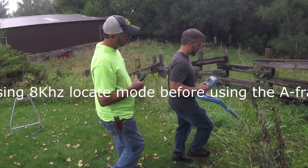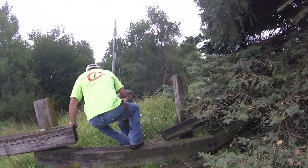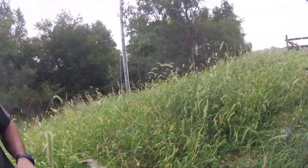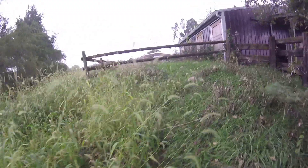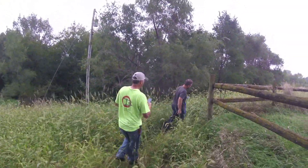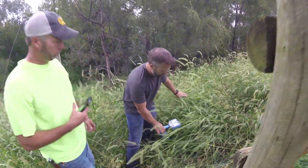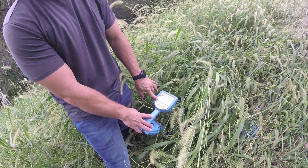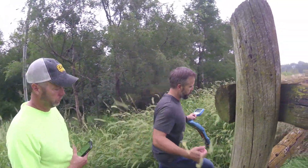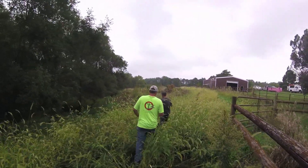Going around the tree and moving along the route. I'll match up my frequency by hitting the F key and get to 8 kilohertz on the receiver as well. We're pushing out about five milliamps back at the transmitter, and right here in the weeds we're picking up almost all of it — 4.25 milliamps — which is a good sign we're probably not faulted between here and where we hooked up. We're measuring five and a half feet deep, so we'll move along. I'm in peak mode, listening to make sure the tone doesn't drop off, which could indicate we're at the fault.